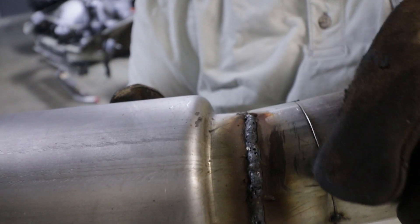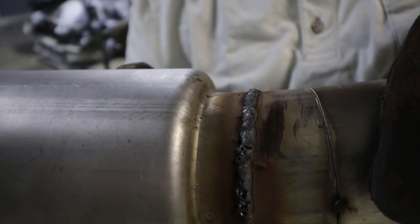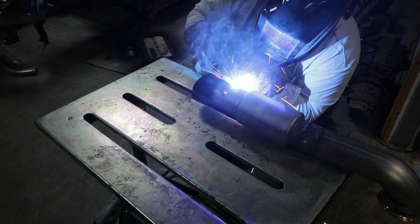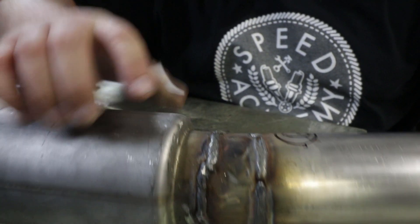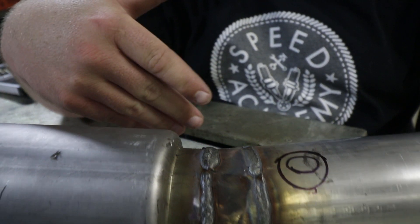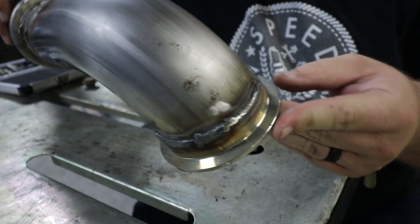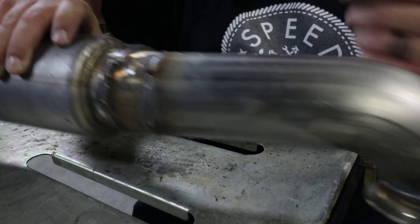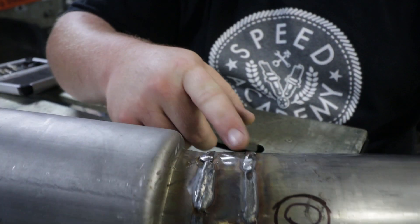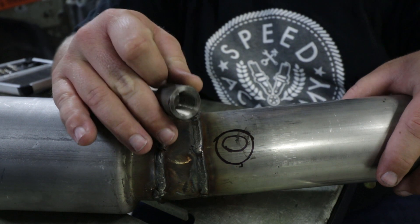This right here is what happens when you forget to turn the gas on. Don't do that. Now I get to grind all that off. I got everything finished and welded. Unfortunately, the one where the gas was turned off and I had to grind it back down made it difficult to see where I should weld and it turned into a bit of a disaster. Some of the others turned out okay. I'm not a professional by any stretch of the imagination, but A — it's going to be wrapped, so it's going to be pretty well hidden, and B — the areas I thought I had potential issues, I ground down to make sure I didn't have any pinholes or anything. I think we're in good shape.